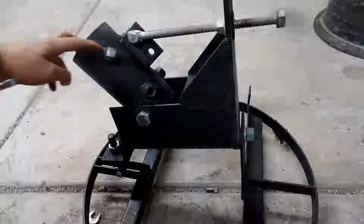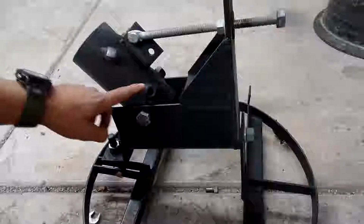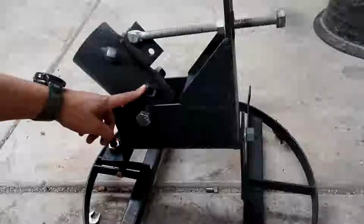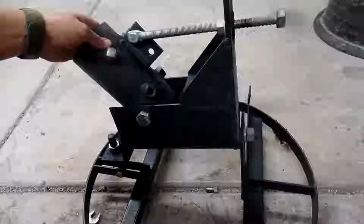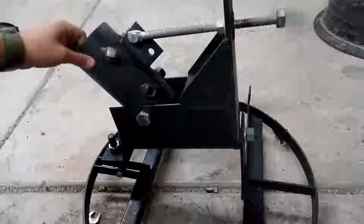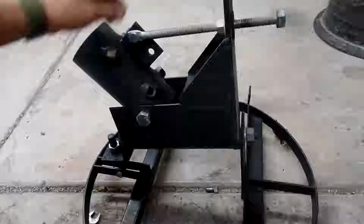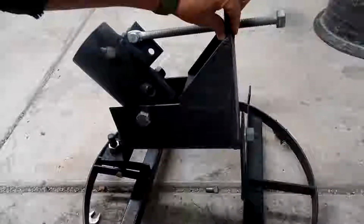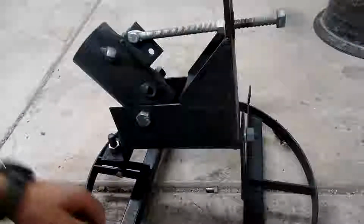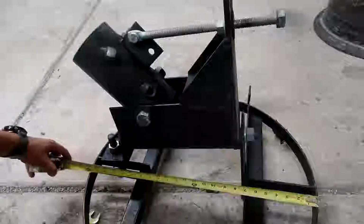Looking at this thing, the build quality is kind of amazing. It's all real thick stuff. These are big old 5/8-11 all thread bolts and big old weld nuts on there. I'm not sure if they're weld nuts. They might just be normal nuts welded to that. 3/16 on the pipe. I'm not even going to say what schedule that would be. That looks like 5/16 or 3/8 plate here. 8-gauge gussets. Yeah, the thing's well built. And the round part on it here is 2 foot.